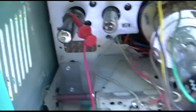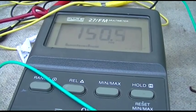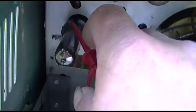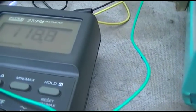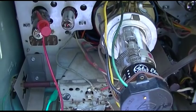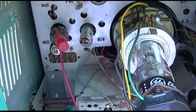We have our test adapter there. On pin 5 we have 160 volts, and that should drop as the tubes warm up. On pin 6 we're reading 118 volts — we're a little bit low. But we did not change the selenium stack in this yet, so 10 volts off is no big deal.